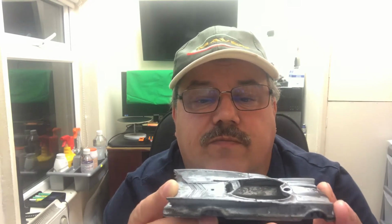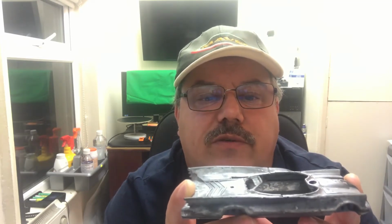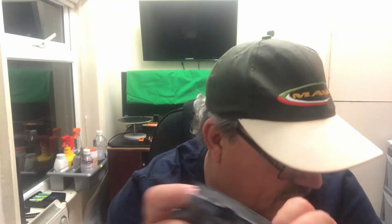At this moment in time, I've got another one of these coming through the post. I'll be tidying up the carcass of this one. So far I've stripped it and I've put some super glue and baking soda on one of the cracked joints. The body and chassis didn't fit very well, so I've tidied that up as per Bob's instructions, I'll add. It wants a bit more filing doing to it, and then it's going to be wire brushed, ready for priming. So that's that.